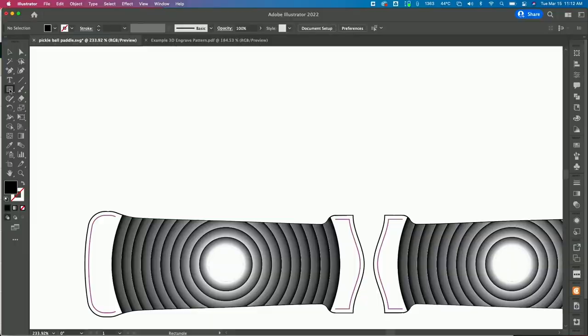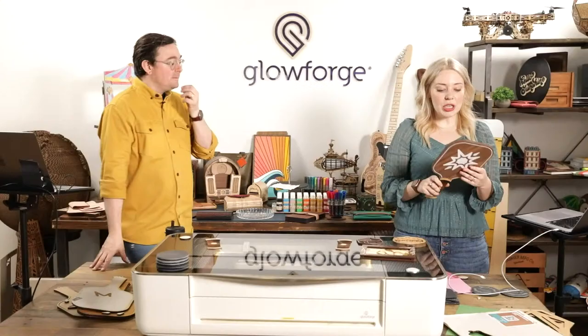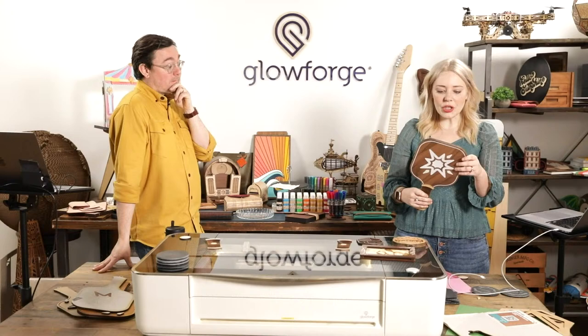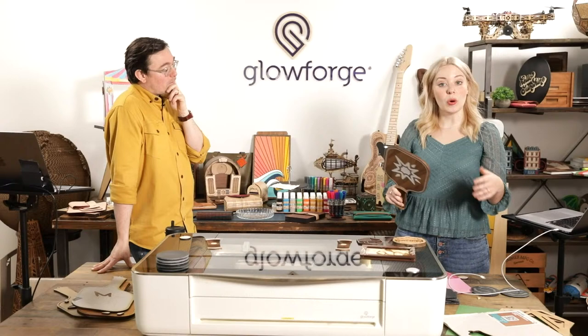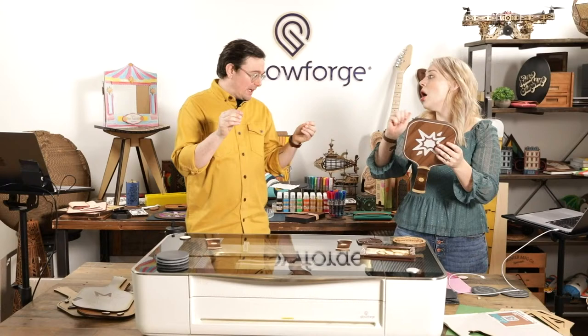Let's do it like this. They're asking, does spray paint stick well to proof grade? It's a good question, because the proof grade is pre-finished. So it's more porous if you were to paint on like the draft board. I use the paint pens on that a lot. I mean, this looks like it's stayed in pretty well. It's not going to stick as well as if you were to abrade the surface slightly to provide a key. So if you had just sanded it just a bit. Absolutely, yeah. For this demonstration, I just sprayed it right on.